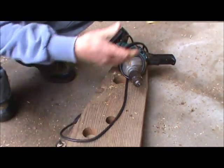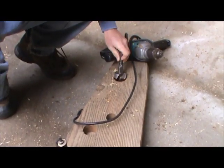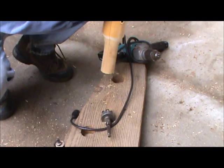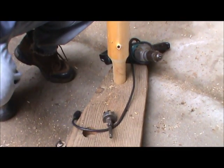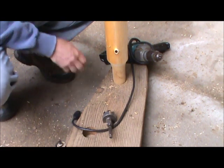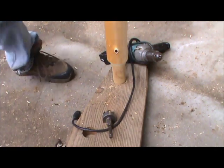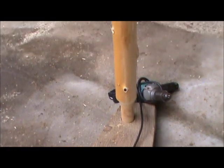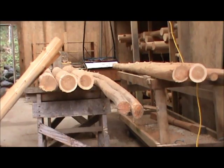And then the mortise, obviously, sorry, the auger will cut the mortise, and then you can put the tenon in like that, and hopefully that'll all work as it comes together. I'm going to do this on my machine, which is slightly more designed for building this kind of stuff. The first thing is to trim the ends of your log so they're the right length.